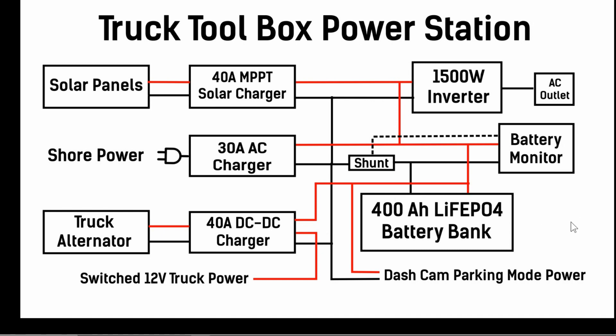For AC power I have a 1500-watt inverter I reviewed back in the winter - it's called Alpha. I've installed that with an AC outlet so I can plug in things like a vacuum cleaner or tools. It's also a way to transfer power out of the battery bank into the batteries in my RV. Say the RV is sitting under trees not getting much solar - I take the truck for a few hours, pick up groceries, this charges up, then I can go back and plug my converter charger in the RV into this and transfer the power over. There are losses in the transformation but it's a way to get power back into the RV.